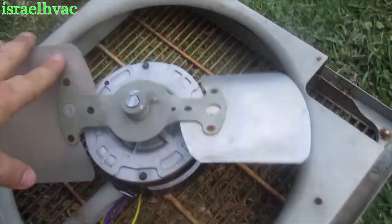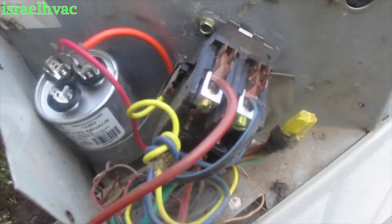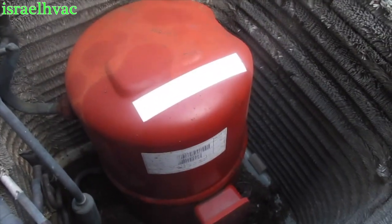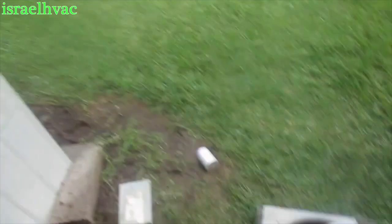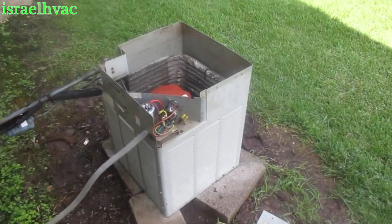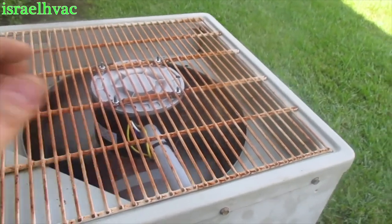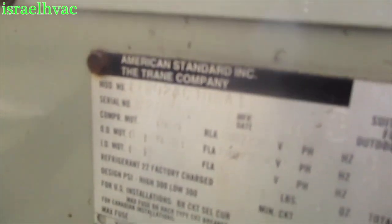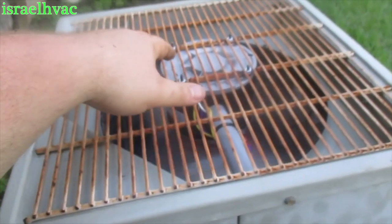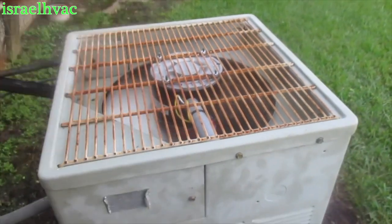Alright guys, I got my new motor on there — spins real free. Look at this control cabinet; that's all the room they give you. The compressor's almost as big as the whole unit. I had to cut the shaft on the fan motor or it was going to touch the compressor. Got it wired up. The little Trane lives — it's a little two-ton. She's pulling heat and running good, with the reversing leads tucked up underneath that conduit.